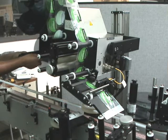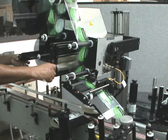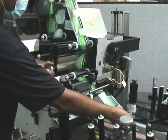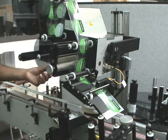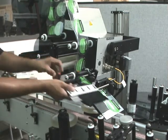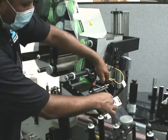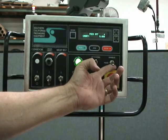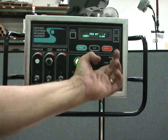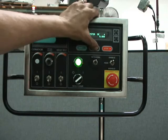If you left enough length on there, just stick it through the rewind and the first couple of labels will take up on their own. The feed is off, demonstrating how you can turn the drive roller without any torque — the feed switch on the control allows this. We've got a couple of labels lined up, the brush is back on, and we're going to jog a few to make sure everything's looking right.